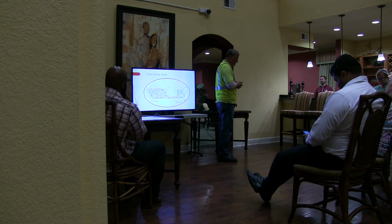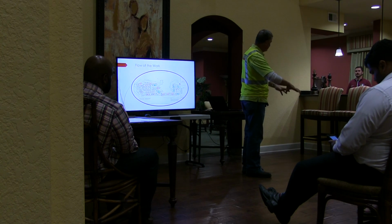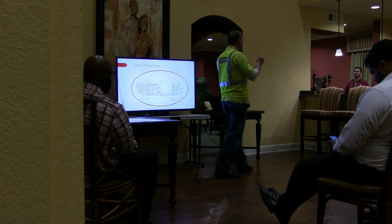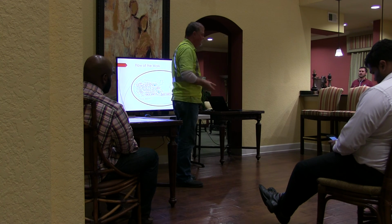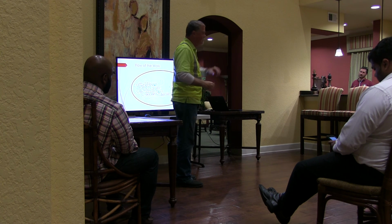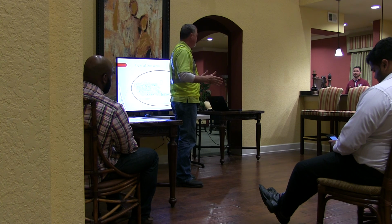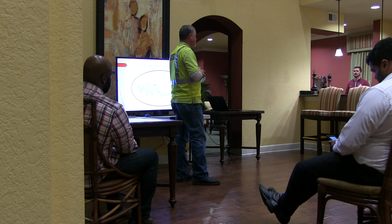Not to bore you with the details, but when we waterproof the balcony, the bulk of the time is on the very front nose where the scuppers are, the way we have to tie in the scuppers. There's how many steps? 42. 42 steps doing this waterproofing. Step 1 is the inside, and then you have to take this flap and the shingles back, and you've got an inside dog here, and it goes back and back. So you start on the front, and that takes a couple hours. The interior fill takes no time. And then the threshold of removing the door. So what we're going to do is get the demo all done inside your balconies. The bands will be on your balconies, ripping out the bands.